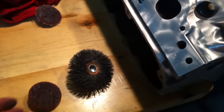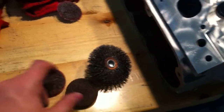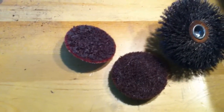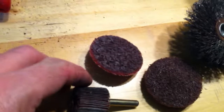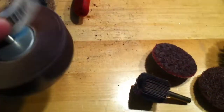Got various different brushes, little wire brushes to clean off the grease. This coarse brush worked pretty good. This one's a little more fine — it seemed to take off some of the edges. You can kind of see the difference in the material there. The flapper wheel worked pretty good; it works on the bigger casting marks a little faster. I probably like this smaller size better than the bigger one, just because you've got a little more control over it.